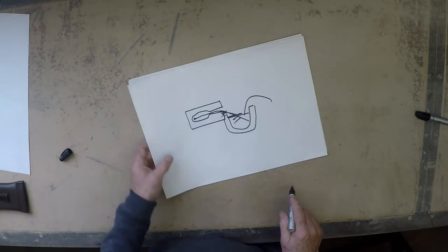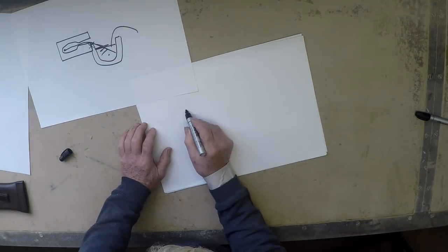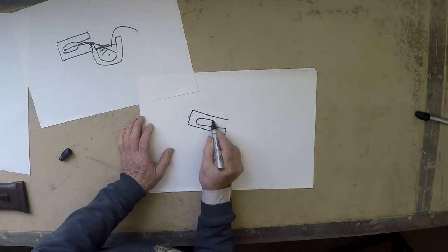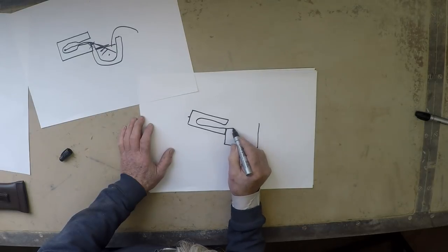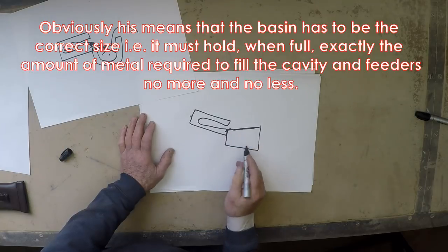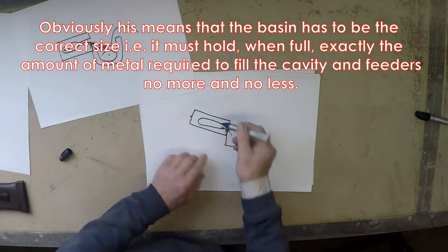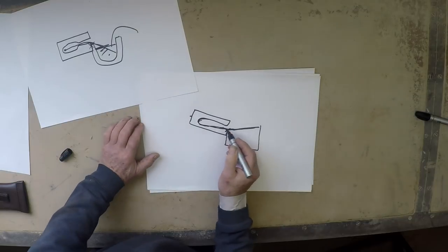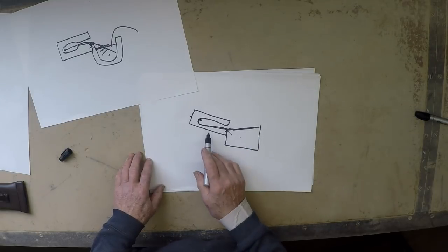Clever people have now investigated the process properly and concluded that the basin has to be the right size. The die has to start in the right position, with the basin seated correctly, and you fill the basin up to the right level. When you start to tilt back, the metal is always almost running uphill into the die. As it slowly goes down, you get back to Derville's process where the metal rolls in as a nice wall — no splashing, no entraining of oxide film — and you wind up with an extremely good casting.